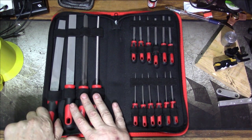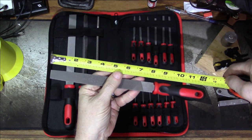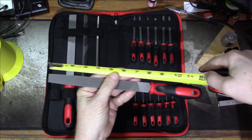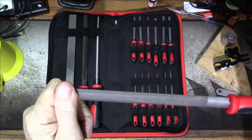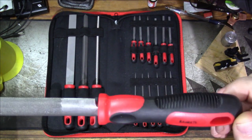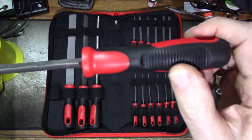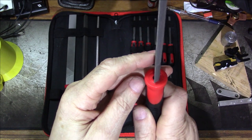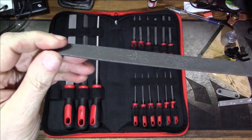Let's take a look at one of the large ones. Let me get a tape measure. You can see the overall length of these files — I don't have a metric tape measure near me today. The files are made out of T12 carbon steel, which should be a very long-lasting steel for a file — it's very hard. The handles are ABS with a TPR black overmolding with a nice grippy area. These should last quite long, and they're firmly attached. The file blade comes straight out of the handle, which is one of my minor pet peeves about files. These look really nice.